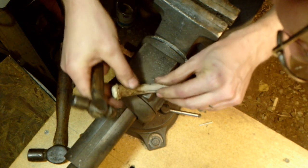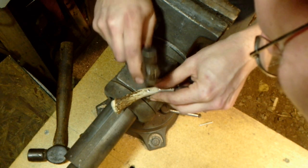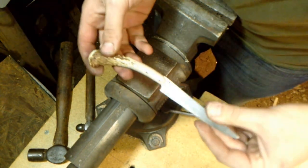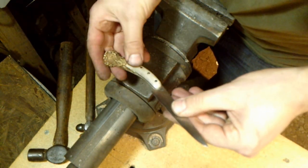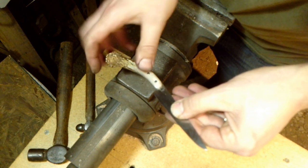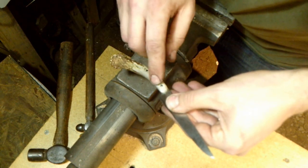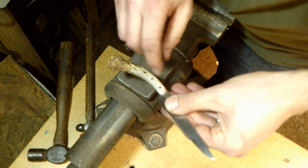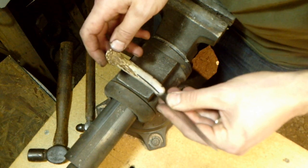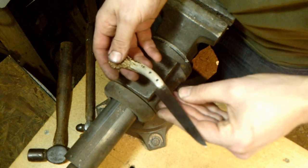I like to try and get my rivet set to where my finger is not catching on either side. Pay attention to make sure the rivet head is filling in everywhere you want - you don't want to see any voids around your rivet, that looks sloppy. Take your time, be careful, just tighten them up to snug and stop - you don't want to overdo it.